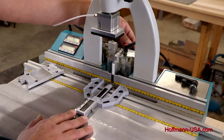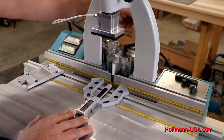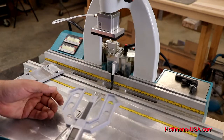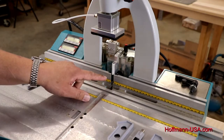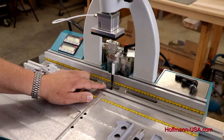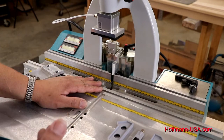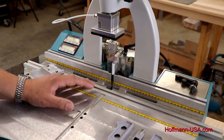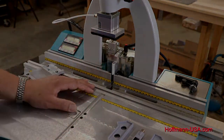I'm at 3.4 right now so I'm going to turn right again to bring that in to 3.5, tighten it up, and that's how I set my router bit. The next step before we put in our chip breaker is to lower the motor back down using the same stem we moved it up with, then we'll make a test cut without a chip breaker. Inserting a key into a joint is the best way to check how tight the joint is — if it pulls accurately and we're happy with the results, then we install the no-chip breaker.